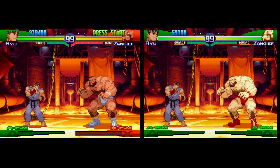But one thing, and this is why I chose Street Fighter Alpha 3 for our example game here, is that 384 mode games are still being cropped to 368 by the Retro GEM. A fix has been implemented for the actual PS1 hardware, but for the PS2 side of things, it's still not implemented. So hopefully we can see that soon. But again, just not enough of a difference over component in my mind to even worry about it, honestly.